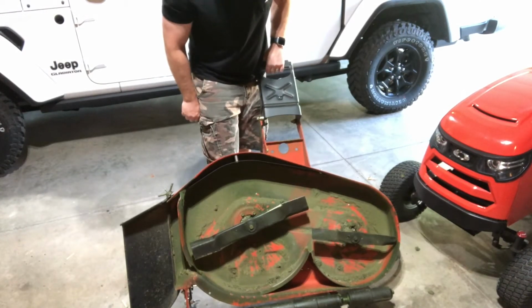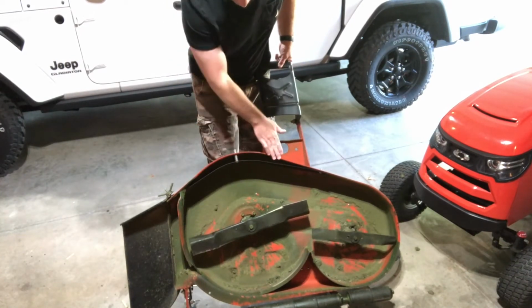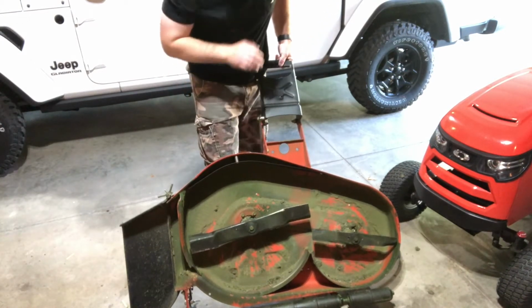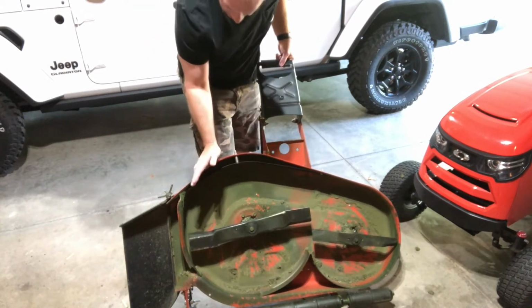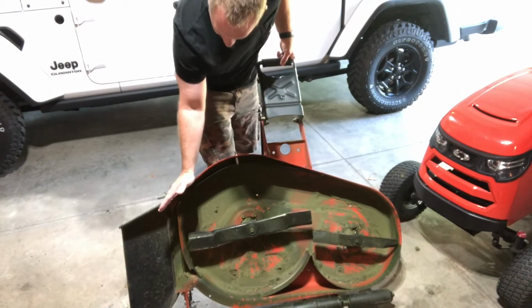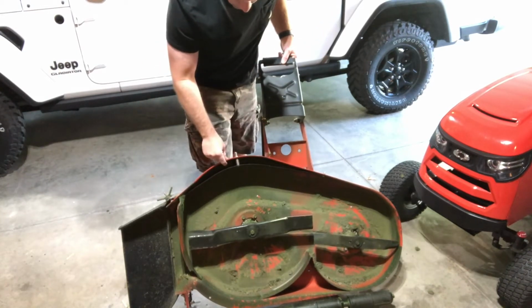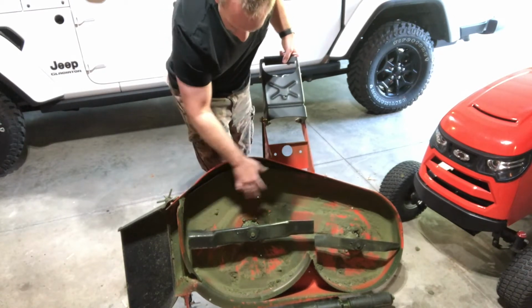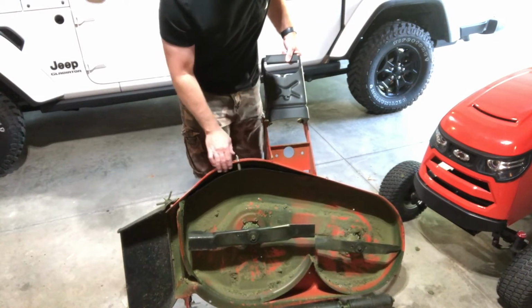It's not a huge difference, so I'm not expecting major differences out of this thing, but you can see it's the black piece here. Basically it reduces this curvature in the front about 2 inches or so. I suppose that does maybe two things. If we take the tangent line of this, it maybe directs the flow straighter out the deck and not tipping it back as far. The other thing, we're reducing the volume in here, so our velocity goes a little bit up in this area. Now, I'm assuming that difference is pretty small just on the reduction in area we have here.